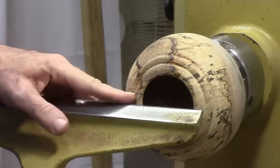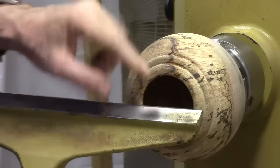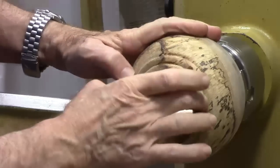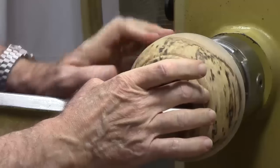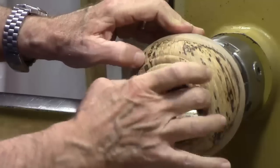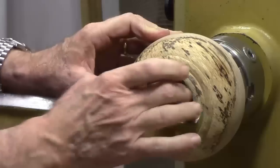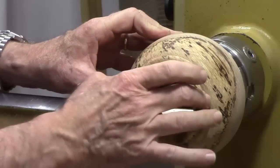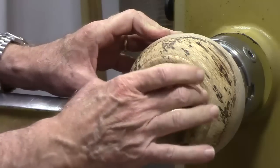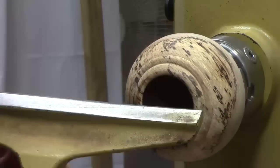Back to the drawing board. When I showed this to my spouse, she said the mouth is too small — and indeed I made it smaller than the one I was mentally picturing that I'd done a while back. So we're going to eliminate this first bead here because we're going to put potpourri in it and it needs to be big enough. That would have made it easier to hollow if we'd started with a bigger mouth. We could have probably done it all with a bowl gouge and scraper without going to hollowing tools. So let me take a bowl gouge and quickly fix that.